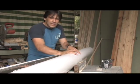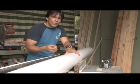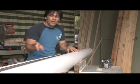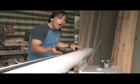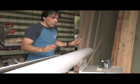When you cut PVC it's very important that you use a brand new sharp blade. Anytime PVC heats up and burns it releases very dangerous and toxic chemicals, so if you use a really sharp blade and cut it fast you won't have to worry about that. A little abrasion from the blade is fine — what you don't want is for it to just sit there and melt the plastic. You want it to chop into it, cut it, get it done quick.